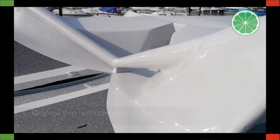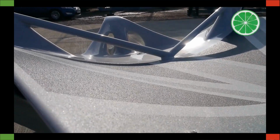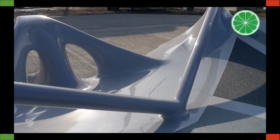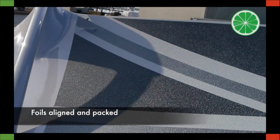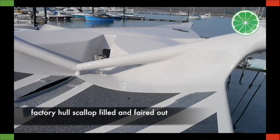You look at some of the other paints we do in our range, Chris, and we go through the data sheets that we do, and it must be sprayed like this, and this is the range of thinners, and this is the viscosity it's got to be at, and all these strict rules we put into the super yacht type stuff. It's just the one thing I find quite refreshing about Durepox is its ability to be changed in its use, and it doesn't give us too much trouble when it's used in that way.